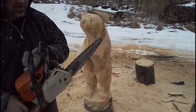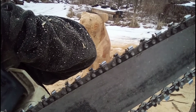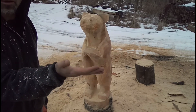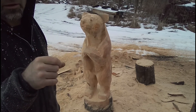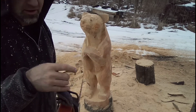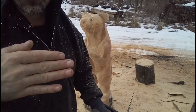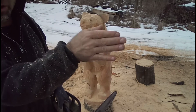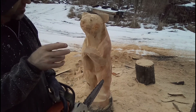Cutting and twisting. That's where, if you take the backs of your teeth off, see, this is a full house chain on here now, and see how I have the backs of the teeth off. Once you get rid of that tail of that tooth, it's like the quill on a feather. That little bit of drag will keep that tooth traveling straight, because the teeth, as they dig into the wood here on the point, they're gonna want to swim a little bit. Now, if you take the back of that tooth off, it's gonna let it swim a little bit more, which is, it's gonna open up the kerf. That's what I was talking about, wider kerf before.